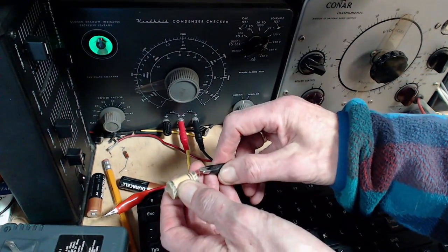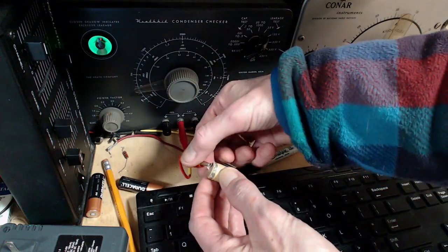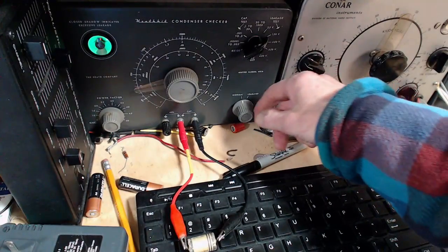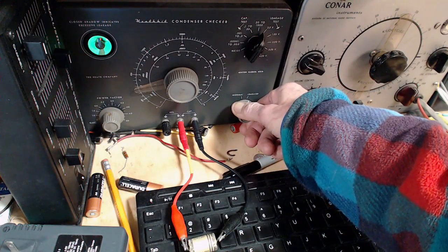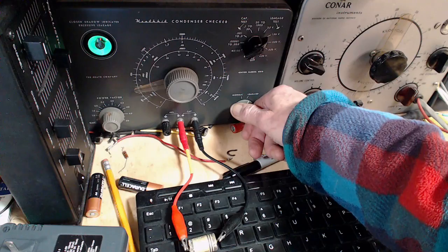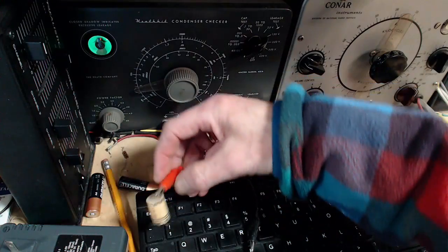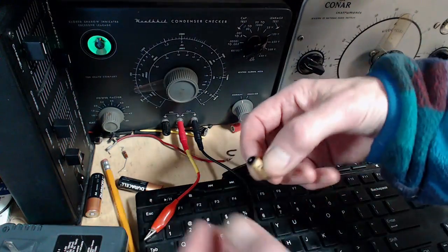This is where I stay honest. People jump in radios and change capacitors and then claim great things have been done. But if you watch my channel, you can see I start up a lot of radios full of ratty capacitors, and the radio kind of works. 50 volts. Here we go. This guy's going to be the same. 150. About the same quality. Very, very slow to charge. I've got a capacitor here with 100 volts on it. Well, certainly not terrible.